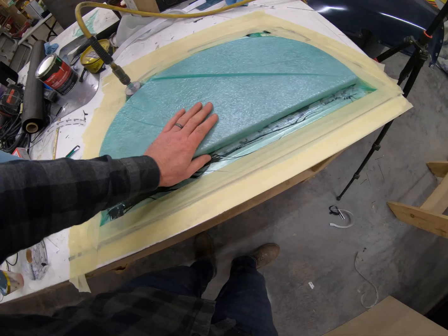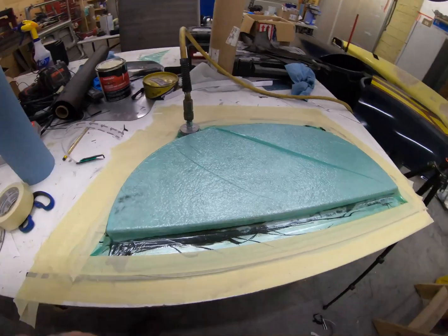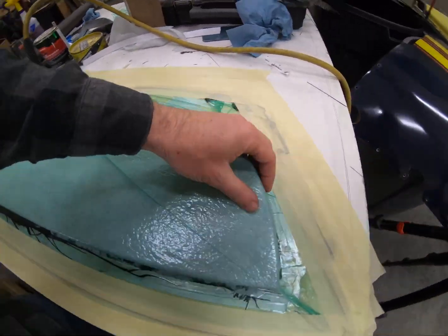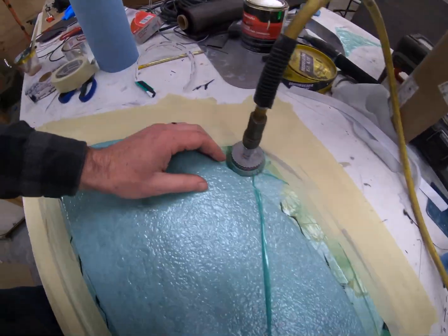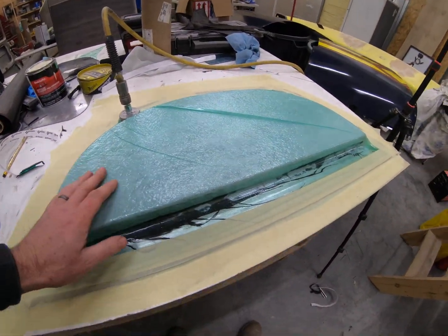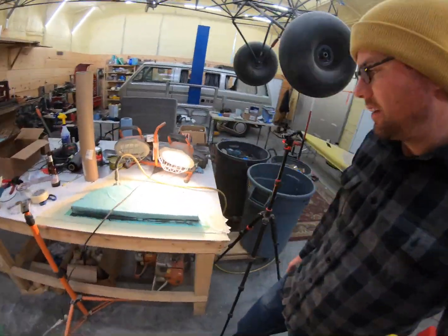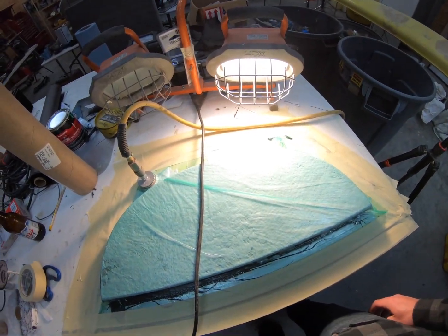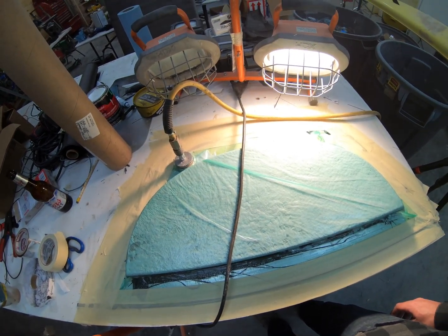Anyway, it's there. I'm getting a pretty good vacuum. Mainly concerned with vacuuming around this, making sure it's all flat and conforms to the mold. There's a little scallop here but I won't use all of this — some will be cut off once I get the panel out. Pretty successful. The layup is complete. Looks like it cured — I've had a light on it with heat going. We'll do another video of unwrapping the present.